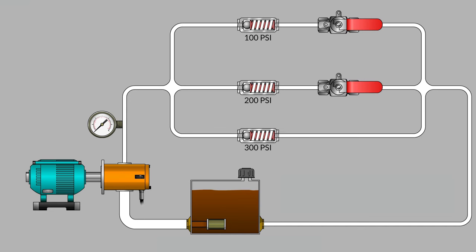Today we're going to have a look at parallel flow paths in hydraulic circuits and also the related concept called path of least resistance. It's very common for oil leaving a hydraulic pump to be split up and used on a variety of parallel branches of flow in a typical hydraulic system. What's not typical about this system is that each of our branches has only a spring-loaded check valve as the main branch load. Typically, each of these three branches would be doing something quite a bit more purposeful.